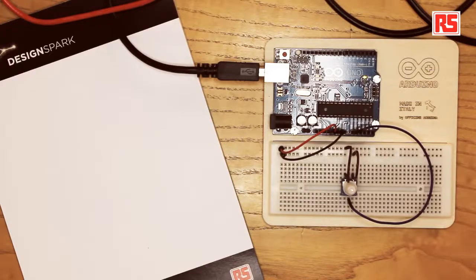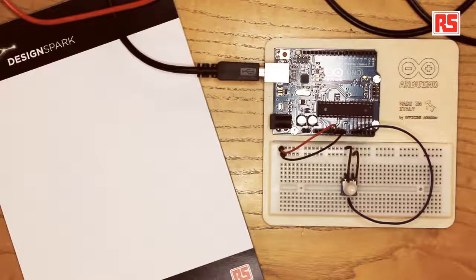We have used serial communication in the past in order to visualize the data that comes from the Arduino board within the Arduino IDE. There is a button on the Arduino IDE called Serial Monitor. If you press that, a small window opens up, and then you can see all the data that comes from the Arduino board scrolling down the small window. And then there is a little menu at the bottom that says normally 9600, and that's, for example, the speed of communication used by the Arduino to send the data. So the speed of sending and the Arduino IDE speed of receiving have to be the same in order to keep the data readable.